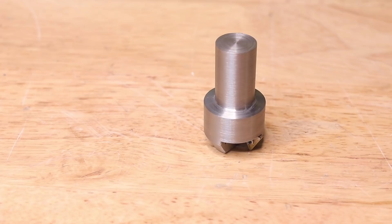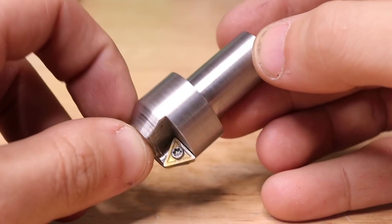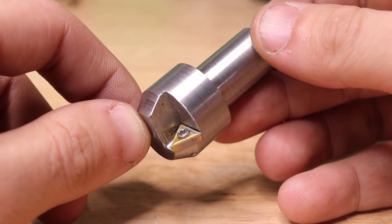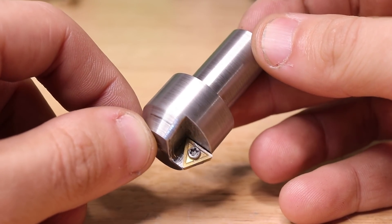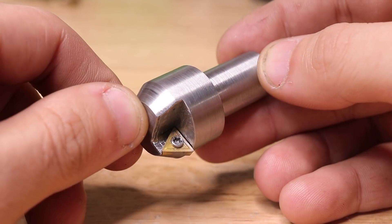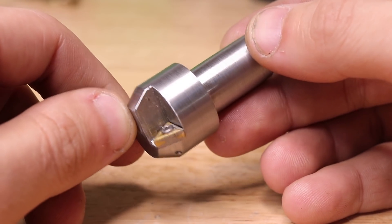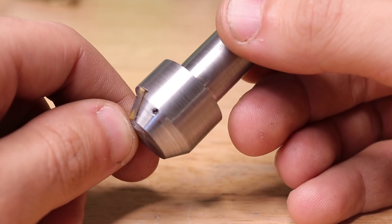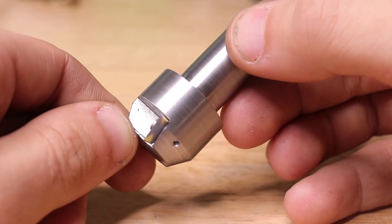For being a tool that I made pretty much off the cuff, measuring as I went, and considering that it was my second project on the new mill, I'm actually pretty happy with how it turned out. The part was within tolerances, but there was a lot of stuff that I could have improved on. For one, I forgot to lock the slide, which resulted in those lines you could see in the cutout.